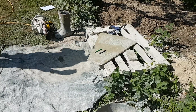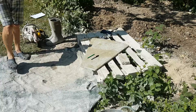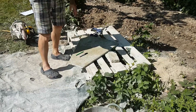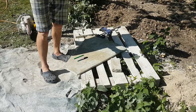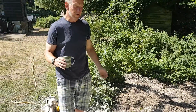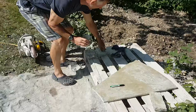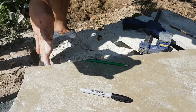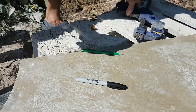This is what I call my workstation that I set up to do all these cuts. The first thing I decided was that the best place to cut was on a normal pallet. The reason for that is the weight of these 22mm limestone slabs — they're very heavy — but the pallet supports them well if you use the slots in the pallet to support the cuts, so it comes through and you haven't got anything falling off while you're holding a very heavy and dangerous saw. On the pallet I've made this backstop, which has just one solid screw in it, so I'm able to adjust it if I want to cut an angle. The backstop is just to stop the slab suddenly jolting backwards.